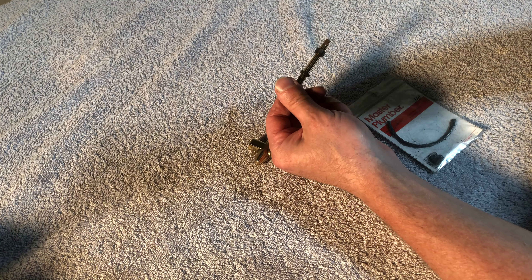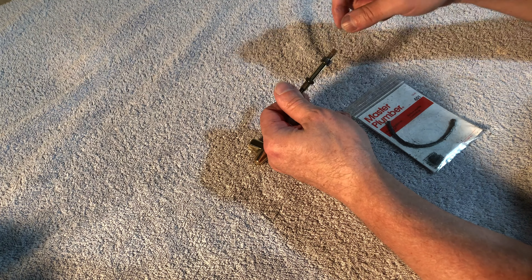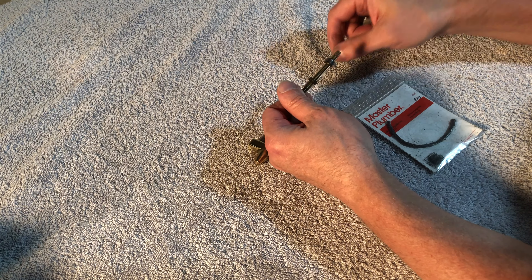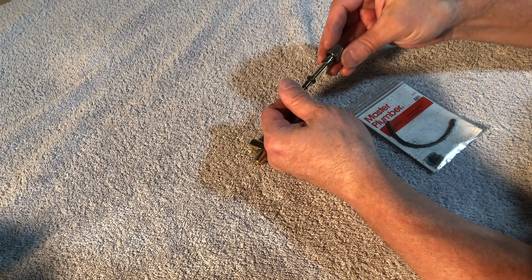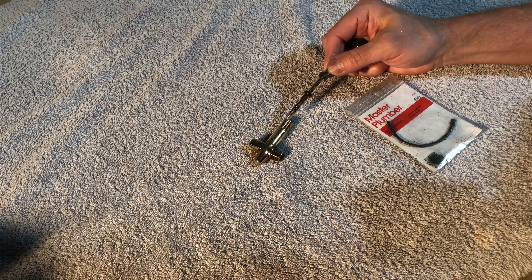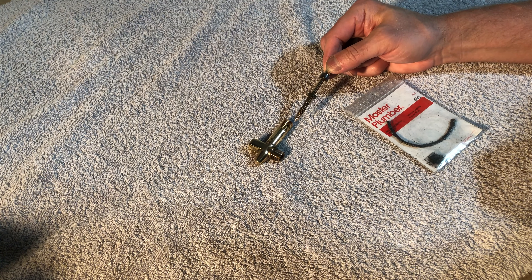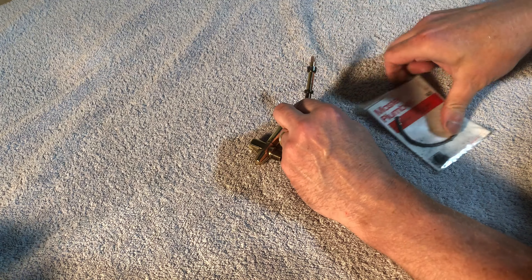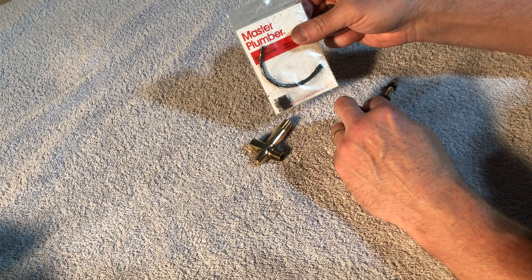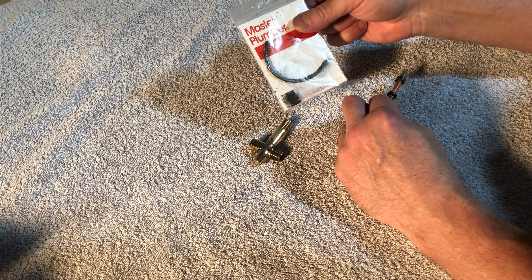We would slide the new packing on. You can buy — if you don't want to do it the hard way — you can do it the easy way and go to Old Coleman Parts and buy a replacement graphite packing, put it on there, and just put it back together. It's quick and easy. I'm on Vancouver Island and don't have easy access to Old Coleman Parts, especially when I get surprised with a project like this in the middle of another project. So I keep graphite packing rope on hand, and as far as I'm concerned it works just as well as the factory packings.